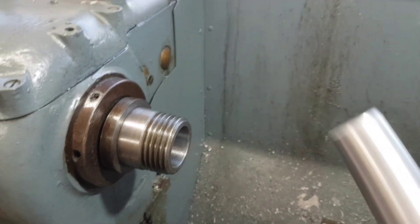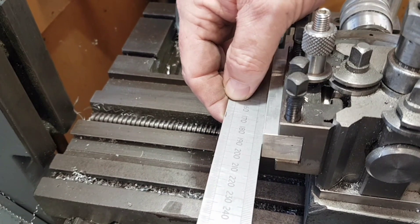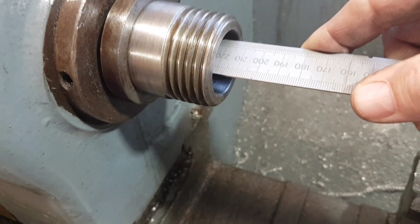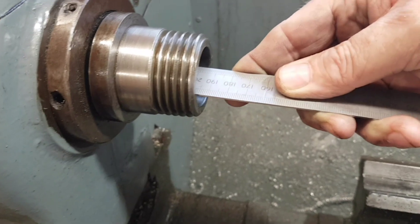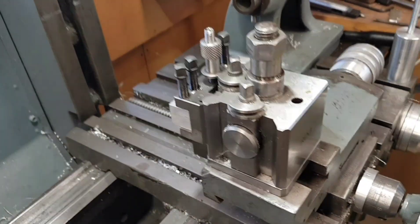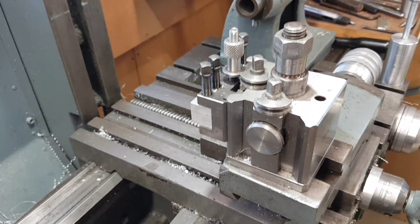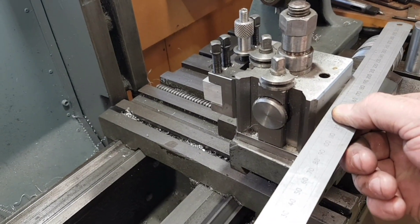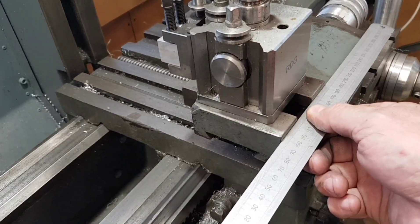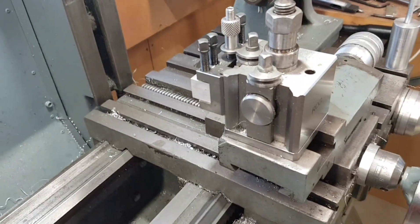My cock-up: I thought I was following Rustanox's technique but I didn't — I followed my own technique that I made up in my head. What I did was put the ruler on the back of one of the tool holders, fed that inside of the spindle, and then adjusted the compound until it touched, making sure it was running level to the centre. I didn't take into consideration that when I changed the angle on the compound from my initial setup, everything else changed — so I wasn't true to the actual compound. That was my mistake.